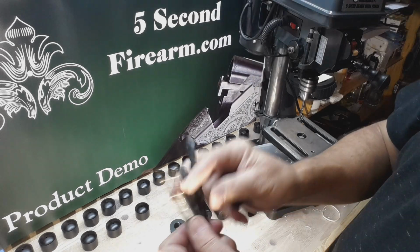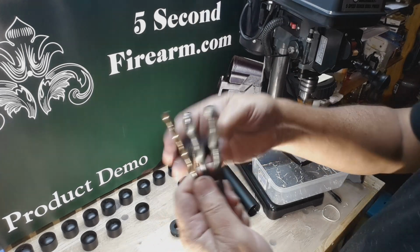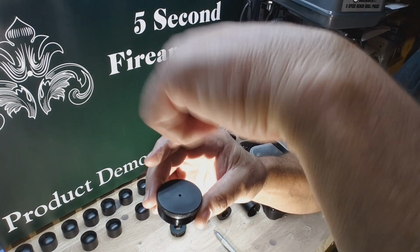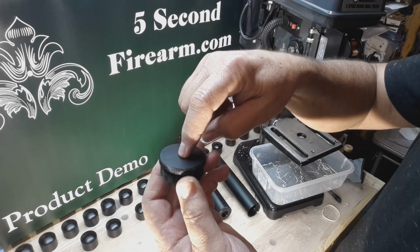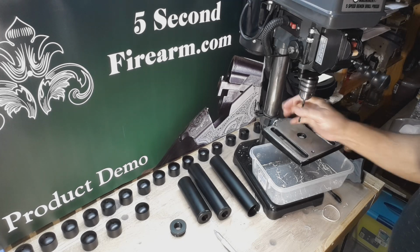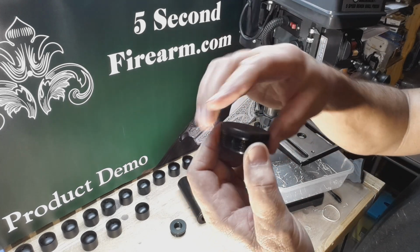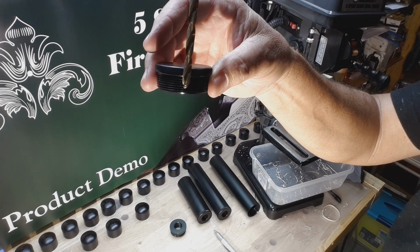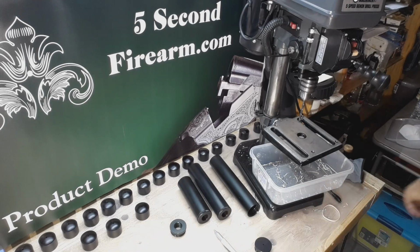What you need to do is start with a small drill bit, go to a little bit larger drill bit, go to a little bit larger, because you're cutting through a pretty good chunk of aluminum, a solid piece of aluminum. So this aluminum is actually going to peel. It'll have some small chips, but most of the debris coming out of the center is going to be in a spiral. So you need to stop probably every 1/4 inch, every 3/8 of an inch, and clean this off of your drill bit and clean the debris out of the hole, and then go back fresh, especially when you're getting farther down into the cap itself, because if you bind that drill bit up, you'll snap the drill bit off in the cap. That's a bad situation. Okay, let's get rolling.